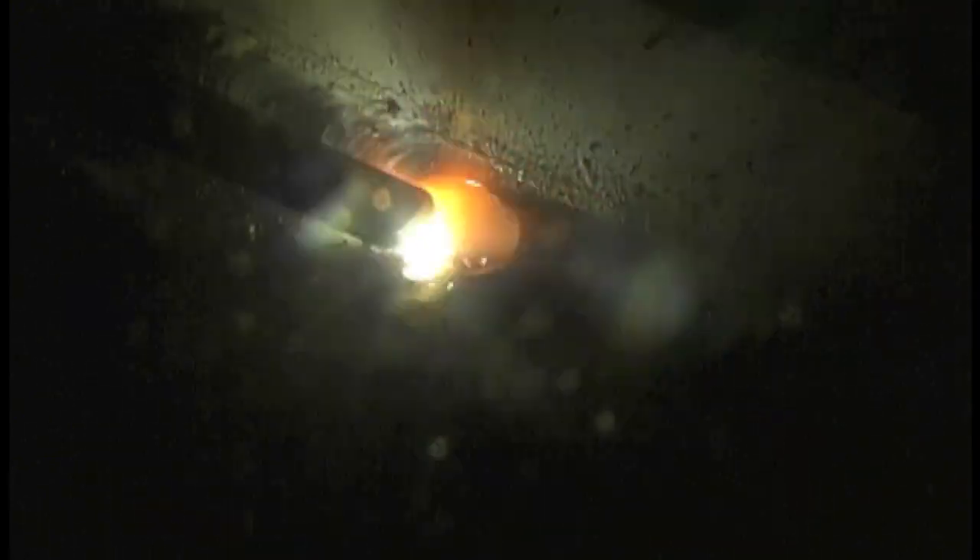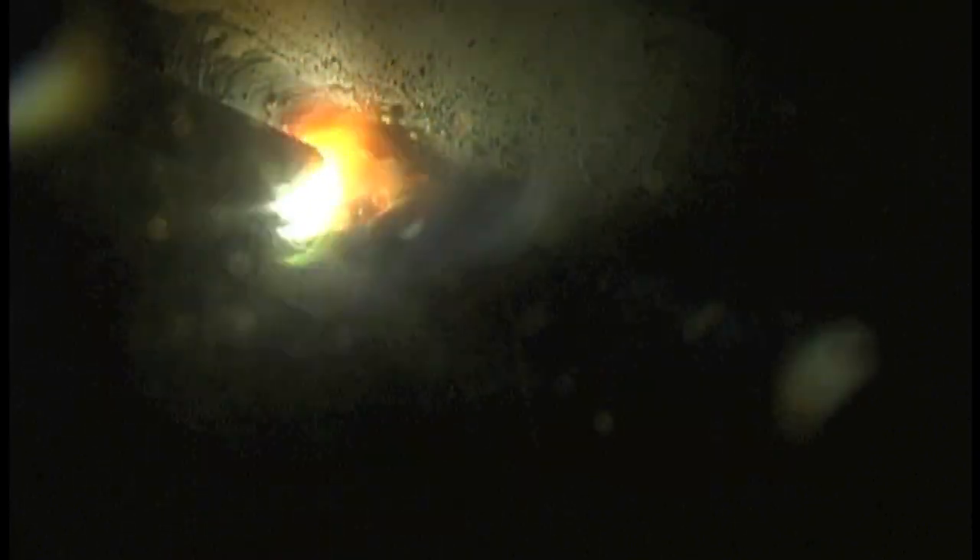You'll notice I'm alternating directions here. Anytime you're doing a multi-pass weld like this, you're going to build up a lot of stress if you go in the same direction every time. Also, when I'm stacking that second bead, I'm much more than halfway overlapped on that by putting this bead on there. That's kind of important — if you put it down too low, like exactly half, you're going to have a low, kind of sunk-in place in the fillet when you're done.